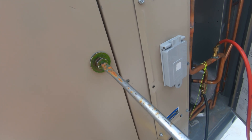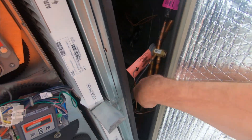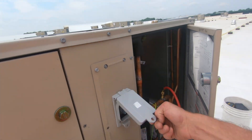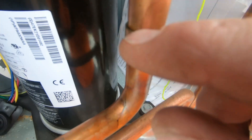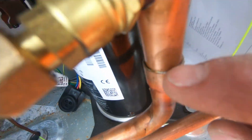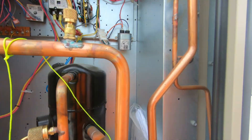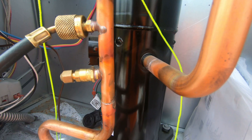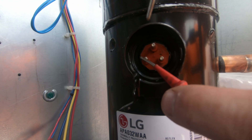Filters look alright. Let's go ahead and shut this thing off. This fitting right here looks very suspicious — if I'm getting it on camera, there's a large gap right there in the weld. I've gotta wonder if it's not low on refrigerant and leaking right there. I don't have much oil or anything. But like I said, I've got 220-some-odd pounds of standing pressure. The compressor is hot, so more than likely it's off on thermal overload. I'm going to test it now, but I bet any money it might be leaking right there.